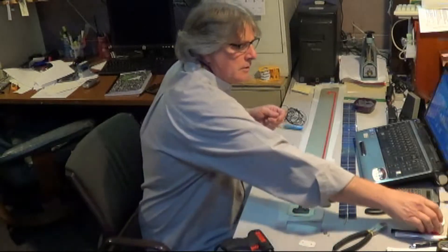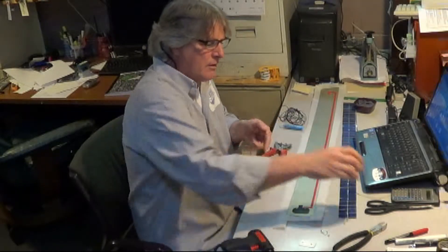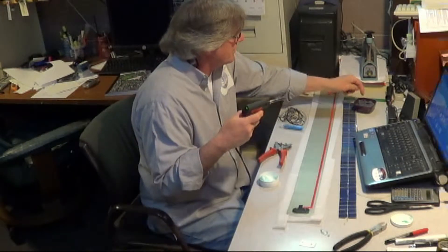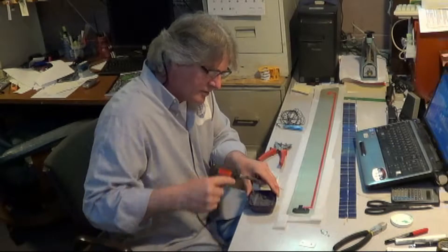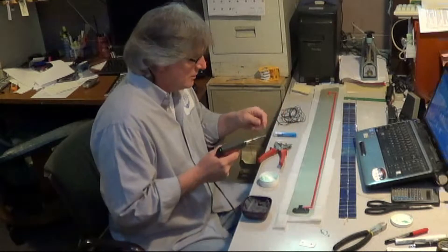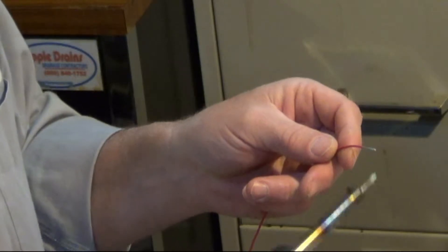What we want to do here, we're also going to need our solder flux. This actually comes in a little canister. We want to just dab the flux right on there, onto your stripped wire. Shock the iron — let's see if it's hot enough here. Looks like it's getting nice and shiny. Just a dab of solder, and we are going to tin the 20 gauge wire. It just takes a second — nice and shiny.